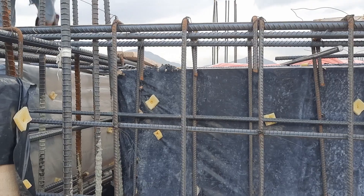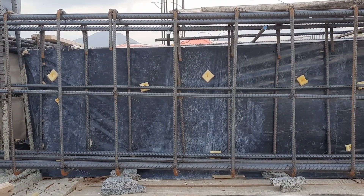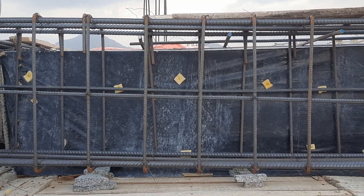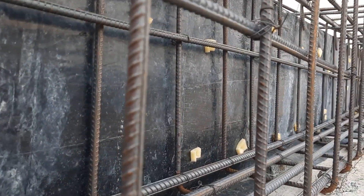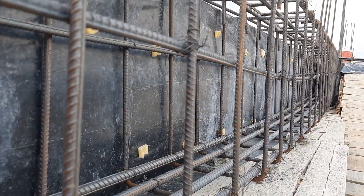But at the distance of L/4, the spacing is 6 inches or 150 mm. This is the L/4 distance where we have negative bending moment or maximum shear stresses. You can see the spacing is 6 inches at L/4, and after L/4 it increases to 7 to 8 inches or 200 mm.